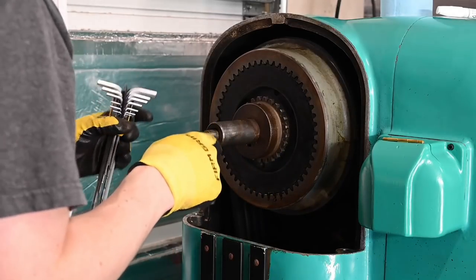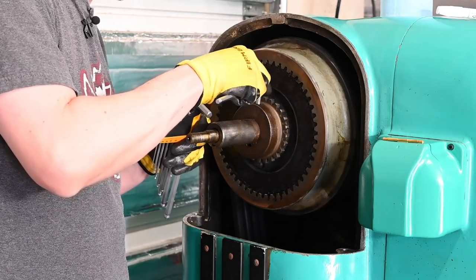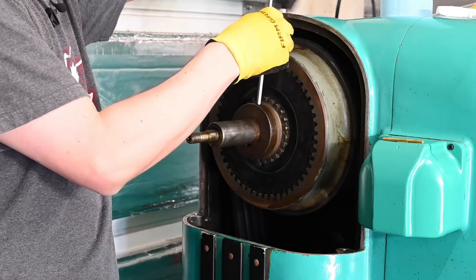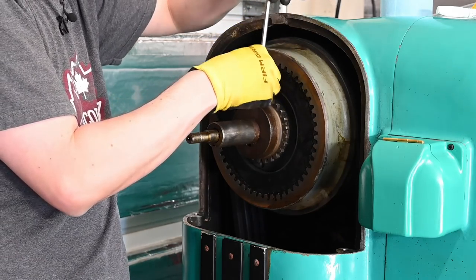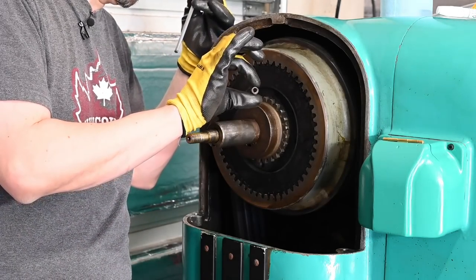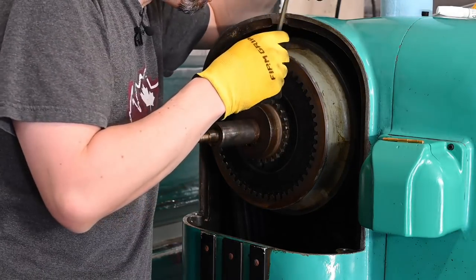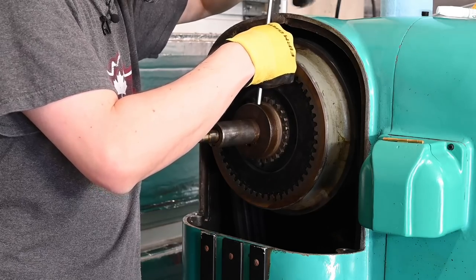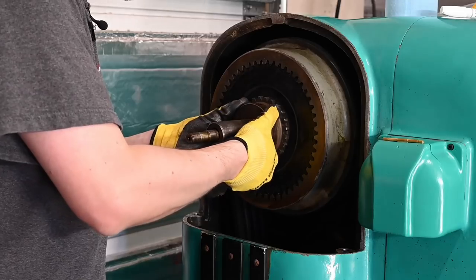I think if I remember correctly, the Practical Machinist thread I was looking at, there's actually a backup set screw underneath this, or maybe this one is considered the backup. So it's basically jamming against the one underneath. Yeah. And that was done as you would expect with a through set screw. It's not just a normal one jammed on top of another normal one. So that one indexes into a hole in the shaft, as I understand.